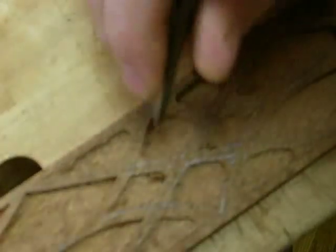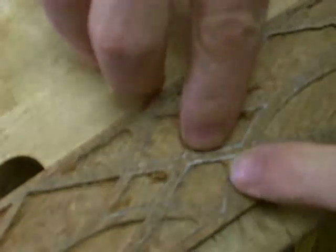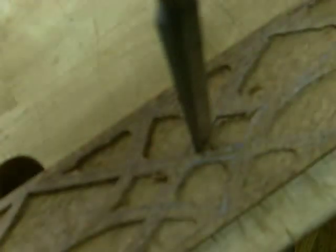I'm going to do one that's out of the camera's way. I'll come in and lightly stab cut it on both sides — stab cut one side. You can see the grain direction on this stuff — see how the grain is all short grain here and it's longer grain on this side. The grain is in opposite directions, so you need to work these tools in opposite directions. This is like the only straight line inside this diamond. You want to just push it down tightly, but you can't because you're going to bust out that other side. So you really just need a lot of patience for this.